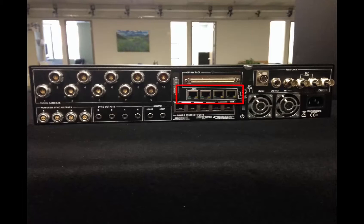Now we have our link ports. These four ports are 10-pin RJ45 sockets. The gray link cable that was sent with your GigaNet — you use these when you have over 10 Vicon cameras and multiple GigaNets. You can connect the GigaNets together using these ports and the 10-pin link cable that was sent with the GigaNet. Lastly, there are 5 Gigabit Ethernet ports. These ports allow connection between the host PC and the GigaNet. For more details, please refer to the T-Series Go Further manual.